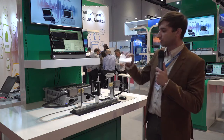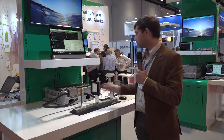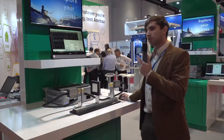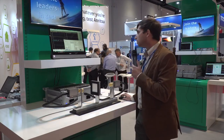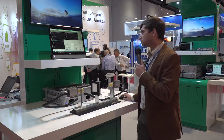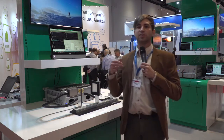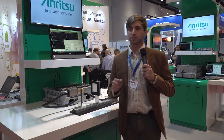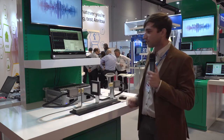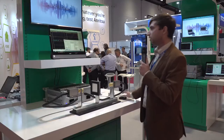Now we can introduce the probe that we want to measure. In this case, PTFE — Teflon — 8 mm thick. Clicking on measure, we have the sample here in the interface. We put the name Teflon, and the thickness that must be known: 8 mm. And the value that we expect it to have — this is a starting point for the iterative algorithm that we're applying afterwards. Teflon is a very well-known material because the dielectric constant stays almost at 2.1 for all the frequency range up to very high frequency. At 77 GHz it will sink a little, but still be very close to 2.1. So I write 2.1 as a starting point, then press measure.